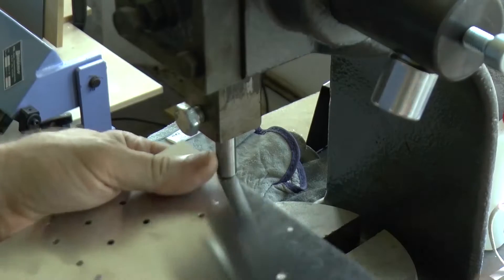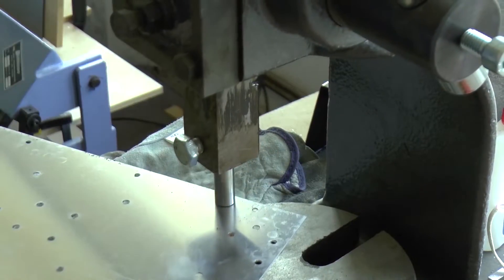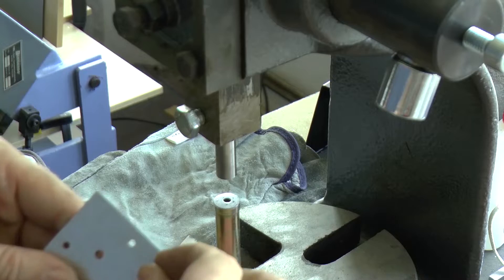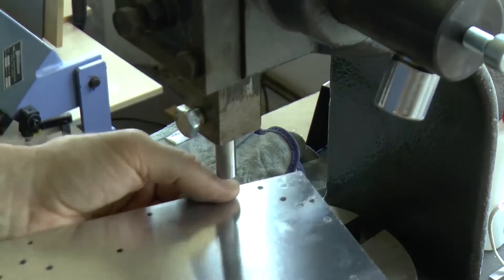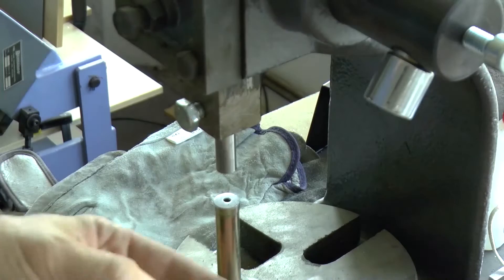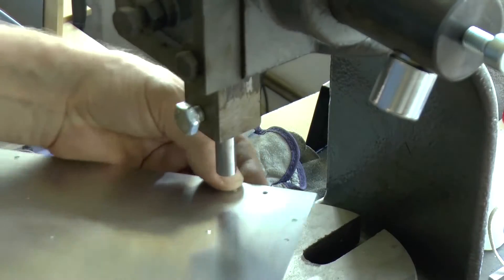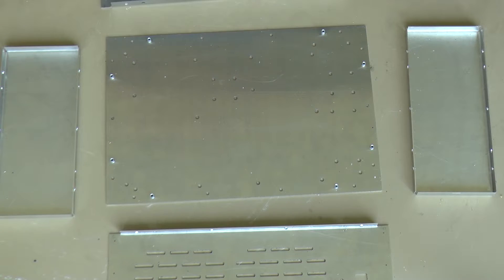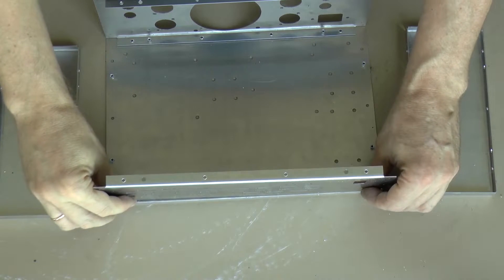In my design, the rigidity of the body is determined by pressed metal threaded rivets — 4.2mm in diameter, made from galvanized steel, far more durable than aluminum parts. I need eight rivets for each part, top and bottom. Thanks to these rivets, load on the screws and aluminum threads is significantly reduced. Screws and threads just functionally press the cover to prevent potential vibration and rattling. The first time using this technology I was surprised by its efficiency — the case was unexpectedly light and at the same time durable. At this point we are getting the answer to whether the previous work goes to the garbage or we simply put it all together.